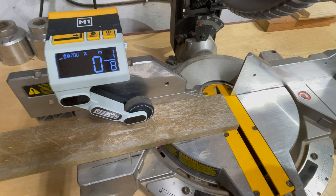Slide the materials to the desired cut location and then start cutting. Select zero button to set point negative value. Blade width is displayed. All right, be sure to only lightly touch the blade. This can cause deflection. Yeah, we got that. Alternately, an initial cut may be made to remove a small amount of material in order to establish a zero position. So, release the arm.